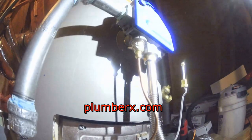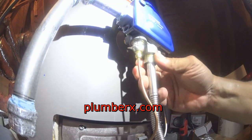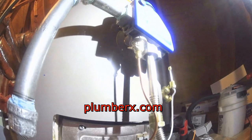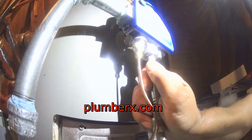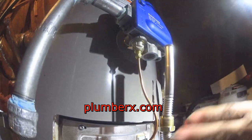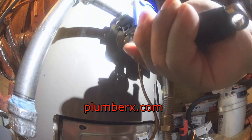At that moment I asked him, "Hey, what kind of water heater are you working with?" And he told me it's a Rheem. And right away I knew the problem. And I asked him, "Did you see a glass tubing in the combustion chamber?" He said, "No, I didn't see that." I said, "Well, you may not have had it. Most likely, it burst, and you'll probably see glass fragments on the bottom of it." But anyway, he was surprised at that.